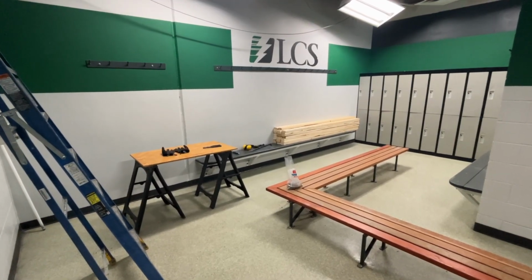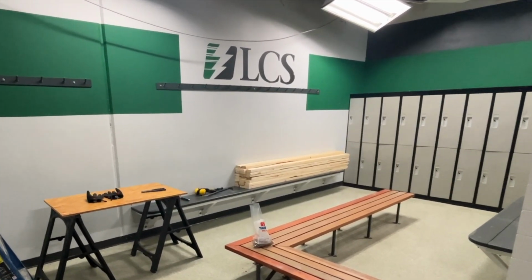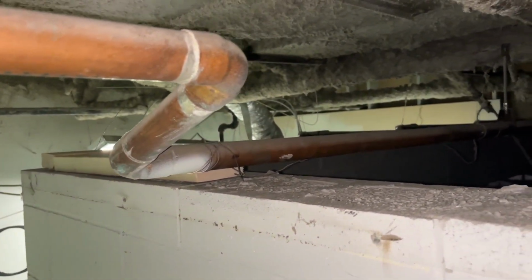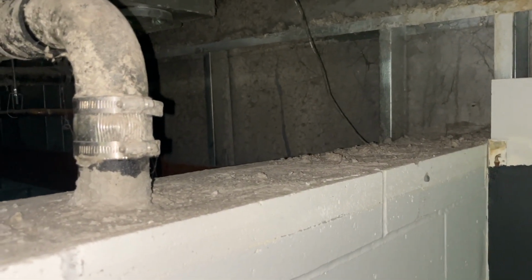framed. Well, I've already gotten word that the sprinkler guys will not need to reconfigure the main line, so I can start in on the pony wall. Okay, what I'm working on now is just measuring out sill plate, putting my blocking in place, and then when I'm finished doing that, I will fasten them to the top of the wall.